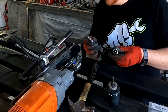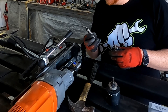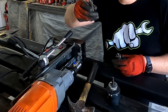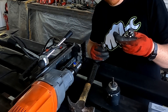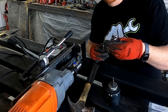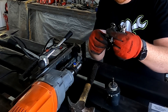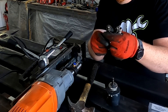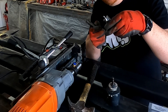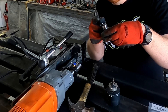Okay, so now we're gonna switch to our annular cutters. I have previously been using a 21/32nds for 5/8 hitch pins; now for this project I'm going to use a 1-inch for my 1-inch bolts. If you'll notice, these have a spring-loaded center pin that acts like a check valve that holds back the cutting fluid until you're ready to cut. Once you start to put pressure on it, it'll open up and let fluid pass through.